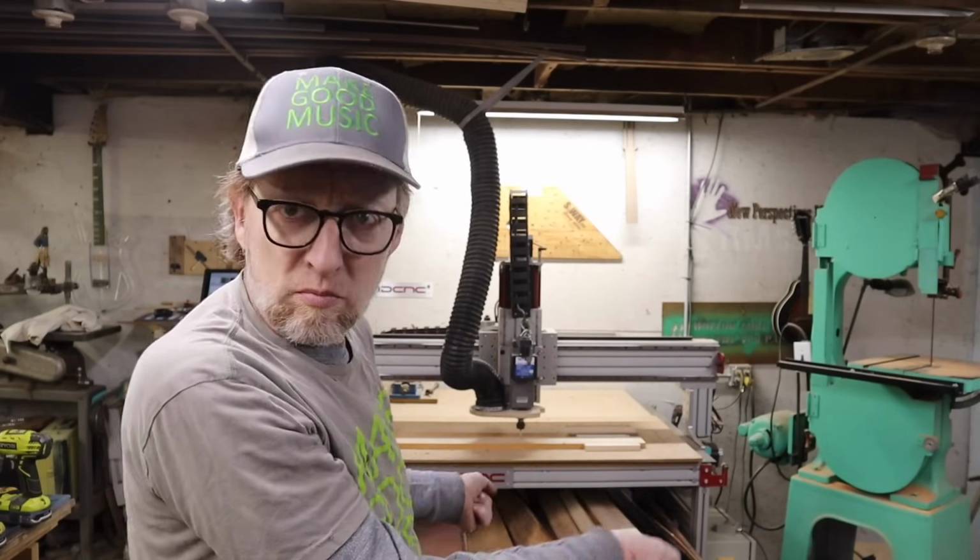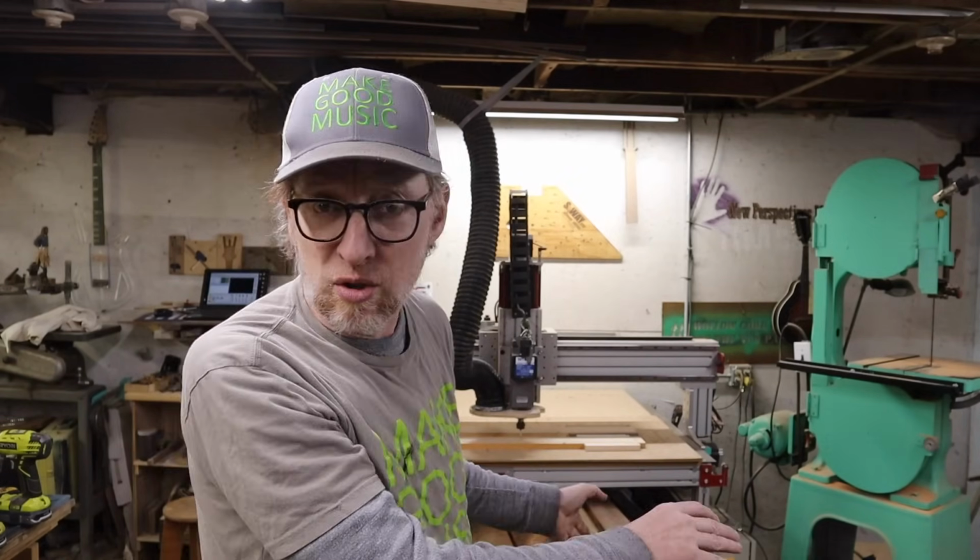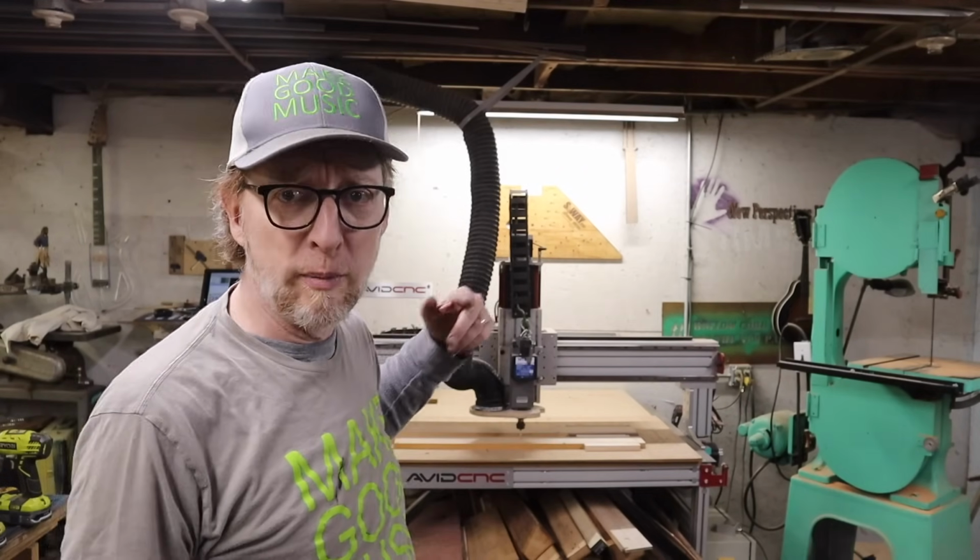If I were doing this, say, every day or once a week, cutting 3 or 4 necks, I could make an MDF template that just snaps onto my board that I can put my blanks into, and then I could just make one big file in the software that does it all for me without having to stop.